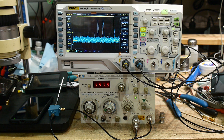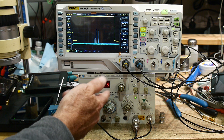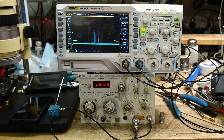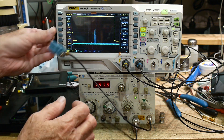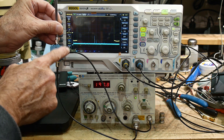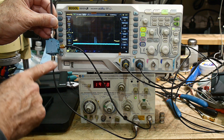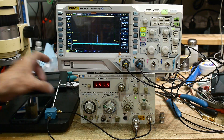So how did I accomplish this? How was I able to get the spectrum analyzer to look at 2.4 gigahertz? It's a really cool trick. The LO of this spectrum analyzer takes the incoming signals and mixes them up to 2 gigahertz. The LO sweeps between 2 gigahertz and 3.5 gigahertz — that's what's coming out of this connector. I'm bringing that into the LO of this external mixer. Whatever comes in on the antenna is being mixed with 2 to 3.5 gigahertz and down converted to an IF frequency. If that IF frequency is between 0.1 and 1500 megahertz, then this spectrum analyzer can see it. That's the way it's being accomplished.